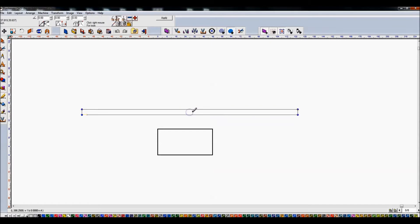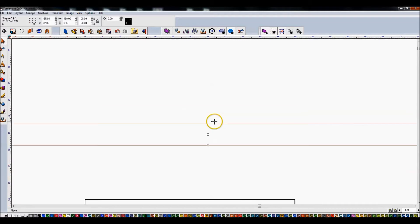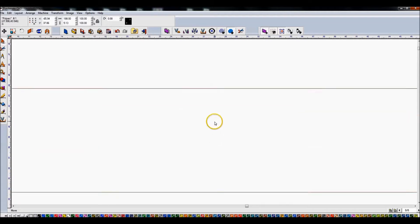Now when I double click on this, I can see I changed the polyarc nodes, which is going to allow me to curve this. There's always been a little bit of a sag in this beam, so what I want to do is add a half-inch bow in the other direction, so that once the weight of the pergola starts to press down on this, it won't look like there's any sag — assuming it pushes it down about an eighth inch. I don't care if it bows up a little bit, I just don't want it to sag like it was previously.